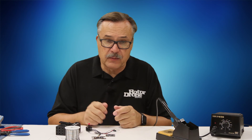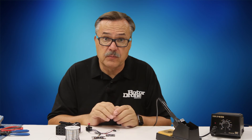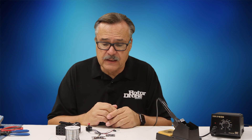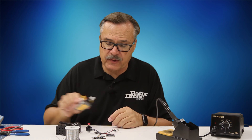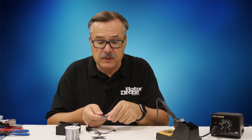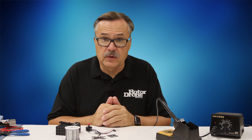I like to keep the heat high and just touch it down for a brief amount of time. My feeling is that when the heat's low and you keep it on the board longer, it dissipates the heat more and spreads it out, which has more chance of affecting the board. That's my own personal philosophy — you don't have to follow it. You would have it on very high for soldering onto a battery plug, and much lower for soldering onto a board like this. Those are the things we're going to be soldering up — let's check that out in the next video.